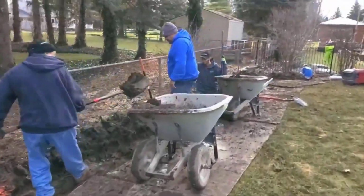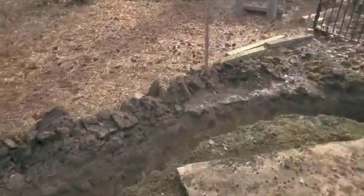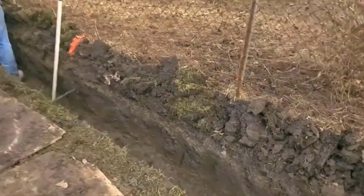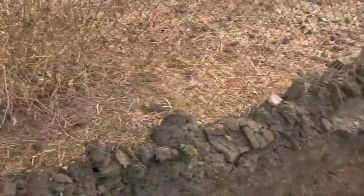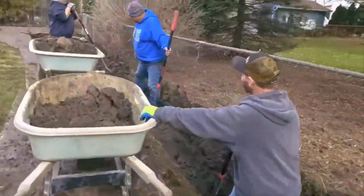Once you cut the sod off, you want the sod cutter to be set at the deepest notch, so you have a nice thick piece of turf and all its root. Then you can start digging. I know that homeowners do a lot of hand dig for DIY. It's super easy to hand dig in the spring. That's when the soil's saturated and clay just cuts like butter. So I really recommend a hand dig in the spring.